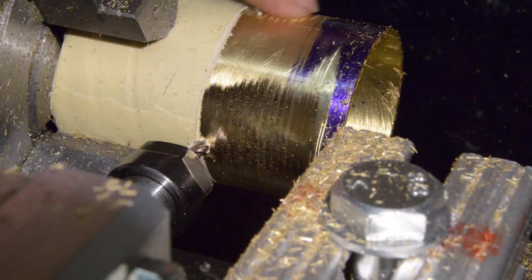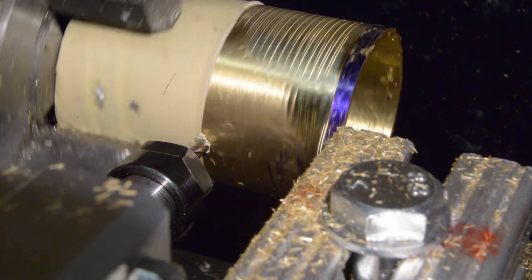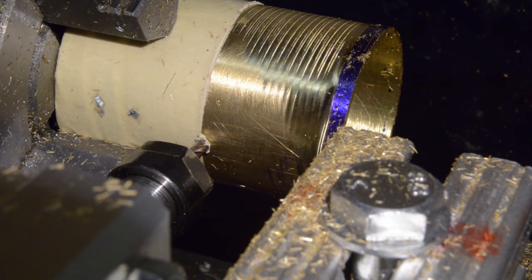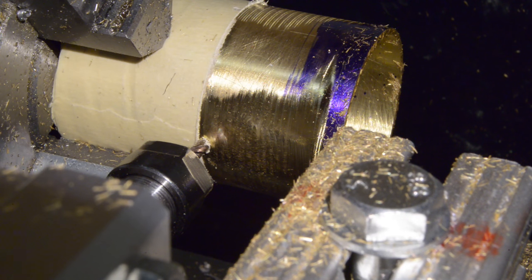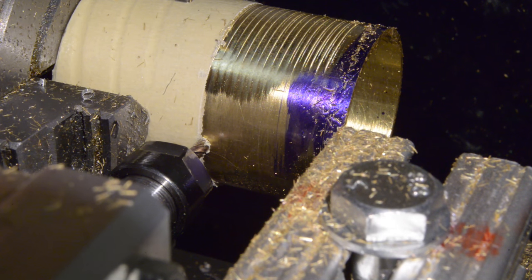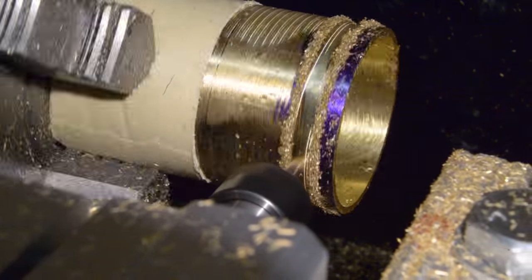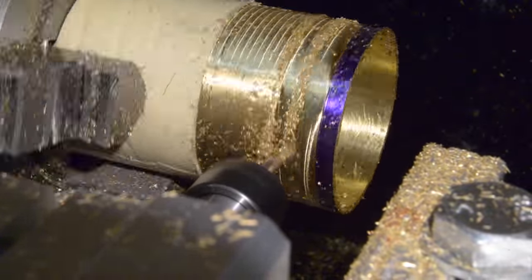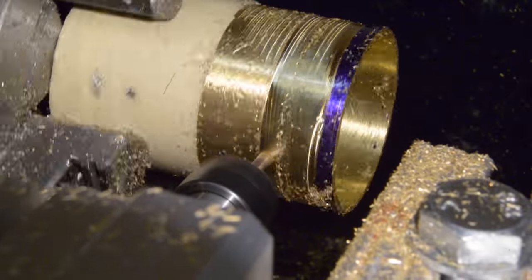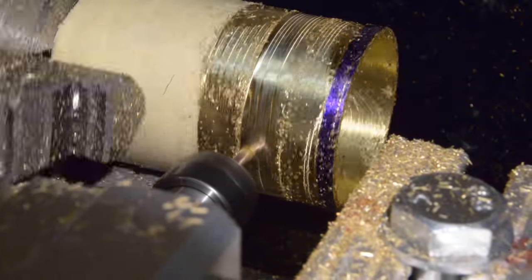You can see there that either this guy is out of round, or more likely I was not indicated well. I probably could have overlapped these passes a little bit more to get a better finish. Just for the sake of niceness, I'm going to move the mill back to the start by backing it under power one inch, then go in a little bit further to find where the low spot is.